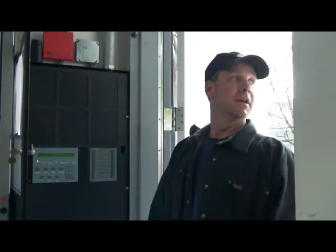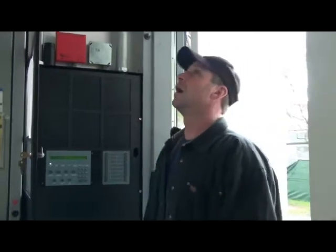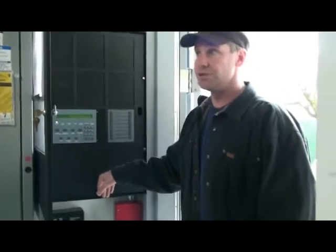I'm sure you looked. He showed you all his smokes and heats in all the different rooms which set off the clean agent. Okay, so this is how it would go down if there was a fire in this building. Their devices on the clean agent panel would detect the fire. Okay, then they would get ready to discharge the clean agent. That would initiate an alarm at this panel right here and sound off the horns and strobes.